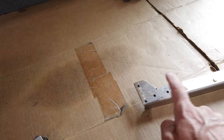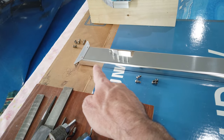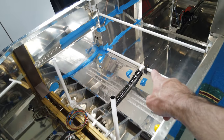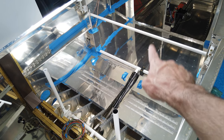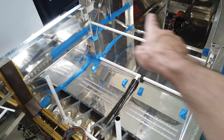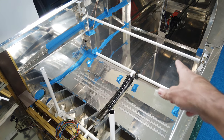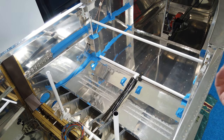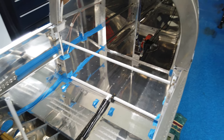I'll have to take a little bit of material off both ends so I can get this back in place. Once it's back in place and bolted, I can go ahead and reinstall the vertical upright that goes right behind my flap control — that vertical piece mounts back there and goes up to the seat cross brace. I had it in before but wanted it out for more room inside to work. The cross brace had to come out anyway to do the riveting, so those all need to go back in.